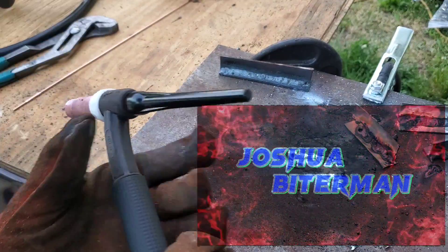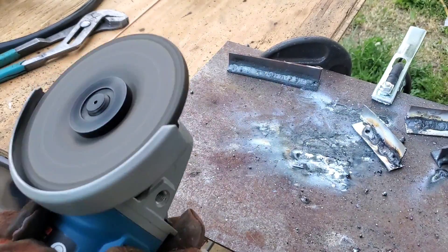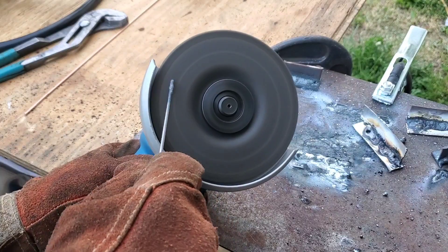It's the age-old story of TIG welding. You have to keep that tungsten uncontaminated, and boy does this one have a booger. We need to grind it. If you're anything like me, you're cheap and you want to use a cheap angle grinder to grind it.